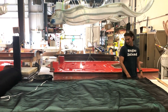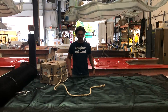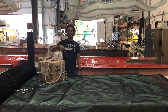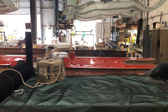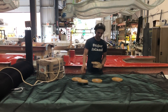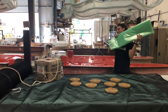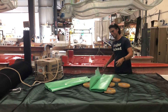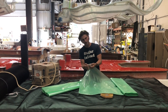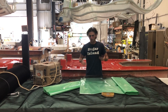But it traps material inside there. Then we go around the edge with rope and create a perimeter vacuum system made entirely out of rope, run around the outside to create a suction manifold — and this gets filled with resin and thrown away. Then you put down tacky tape — rolls of high-grade rubberized tacky tape — which creates a sealed perimeter around the outside. And then you put down a huge, expensive, high-quality ultra vacuum-grade sheet of vacuum bag, and then another sheet for the other part. This isn't cheap, and a great deal of effort goes into making sure it's perfectly vacuum sealed — but you're doing high-quality work with disposable media.